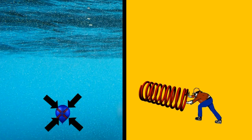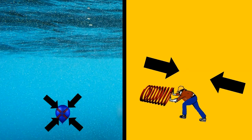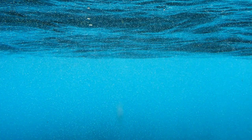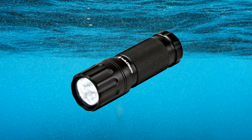Now if you take a balloon filled with air and push it underwater, it shrinks. It's like a person pressing against a spring — the harder they push, the more it compresses until the pressures equalize. A flashlight is like a balloon: if you take it underwater with any air in it, the pressures want to equalize. You won't shrink the aluminum housing, but the seals on the lens will be pushed in by the difference in pressure until something fails.